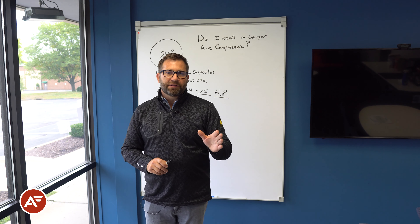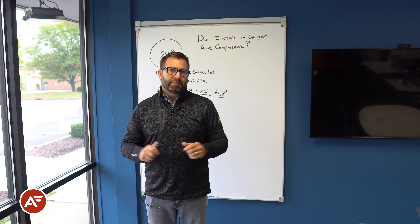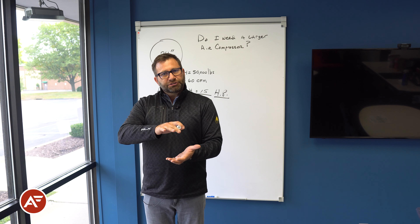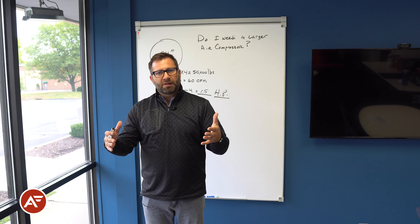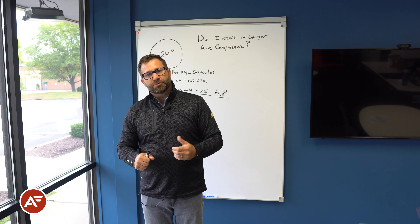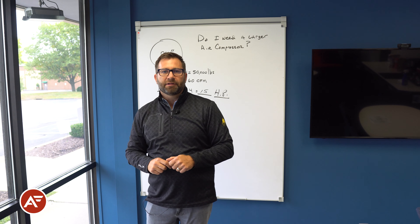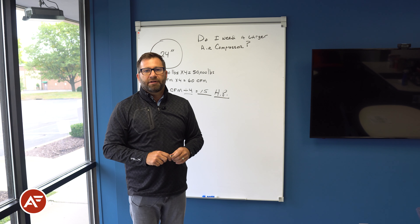The last thought I want to leave you with: when selling air caster technology, don't bother selling to people who aren't willing to make a floor commitment. Many people think they can have a poor floor and just throw more air at it like it's a hovercraft. But as we discussed, higher pressure makes the bearing more rigid, less compliant, and less efficient — simply throwing more air at something doesn't solve the problem. Make sure you have a flooring commitment from your customer upfront. Hopefully you find this video educational and useful, and good luck selling Air Float air caster technology — and remember, not all air casters are created equal.